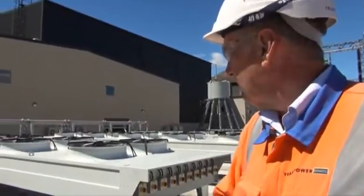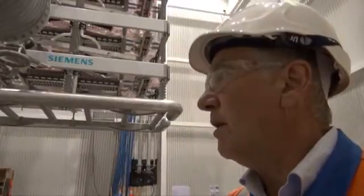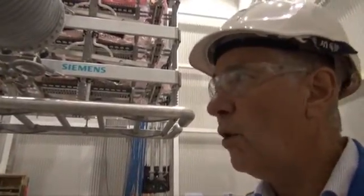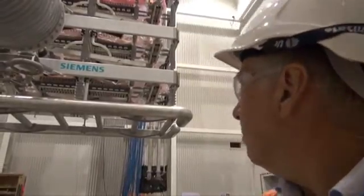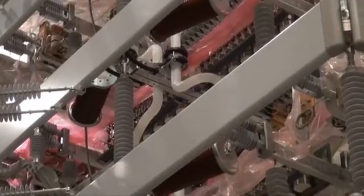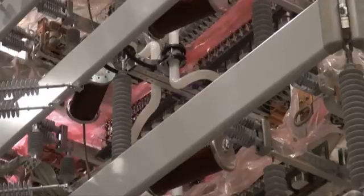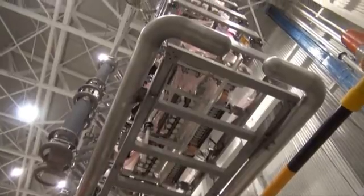That should make a real hum once it's all going. The water is going to be totally pure — de-ionised, pure water for cooling purposes. You can see a lot of plastic pipes up here; those are the main water arteries going into each thyristor group. Sitting up under each thyristor you'll see finer clear white tubes that take the water into the heat sink accompanying each thyristor.